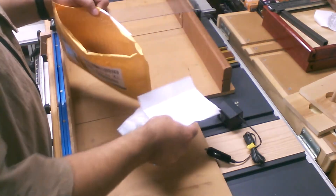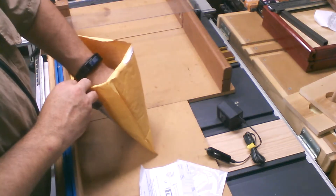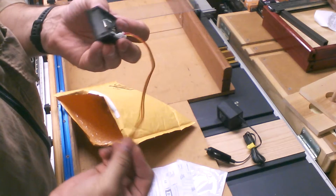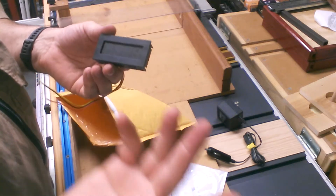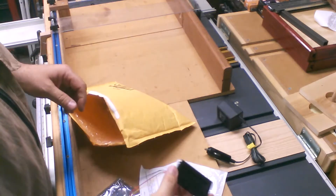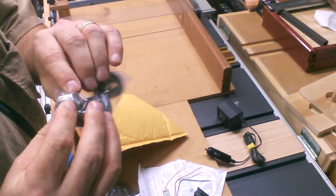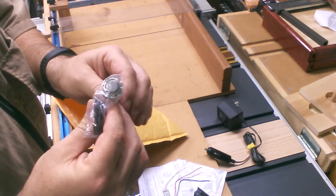Here are some of the things that came in the mail. The tachometer display itself - this one right here. It has a three lead cable and this is going to be a green LED display, which I just thought would be more aesthetically pleasing since the lathe is green. It came with this Hall effect sensor, which we're going to use, and also it's got the little rare earth magnet that will be used to trigger the sensor.